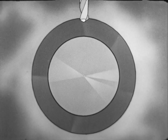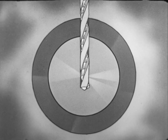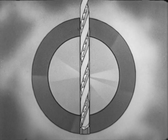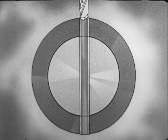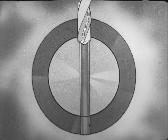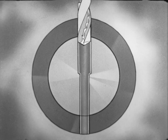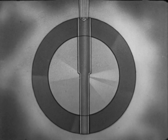Where reamed holes such as this are fairly large, it is good practice to drill the hole the size of the smallest part of the taper pin, then halfway with the drill that is the size of the taper pin at the middle. This saves removing all the metal by hand reaming and guides the taper reamer so it will ream a straight tapered hole.